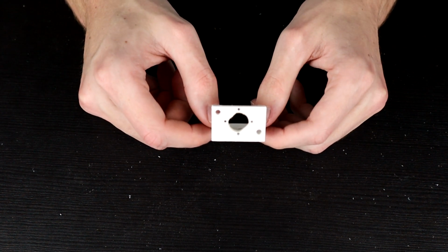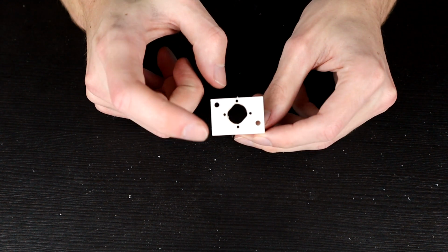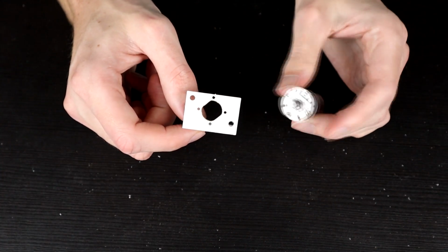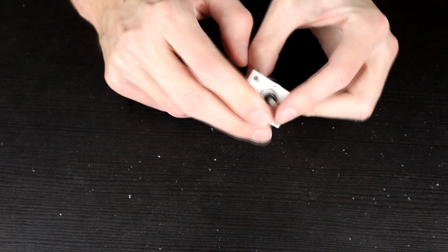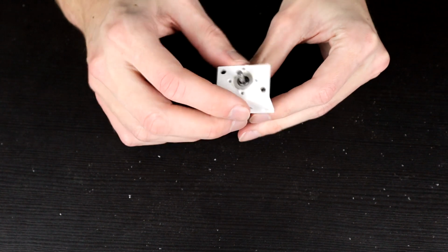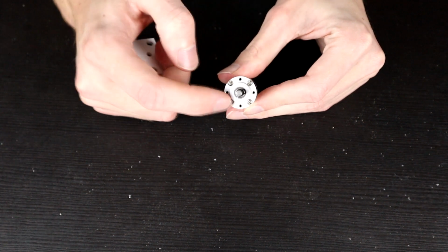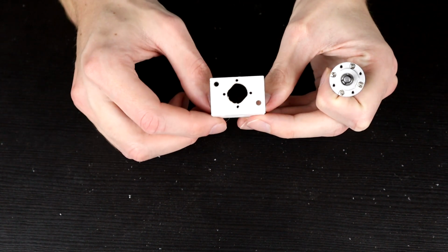Now, this piece here is an angle that mounts up Annie's new drive motors, which are the BBB motors, these ones here, and they have an interesting keying shape on the front of them. They snap into, or can snap into, a certain shape. It's essentially a double flat on a 13 mil round here, which means that you need a shape like this to actually key them into.